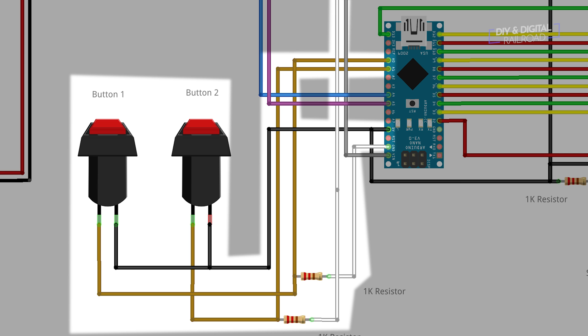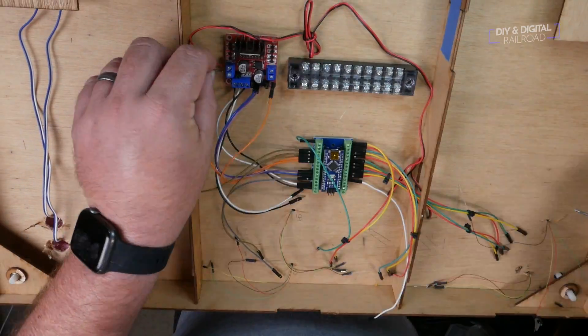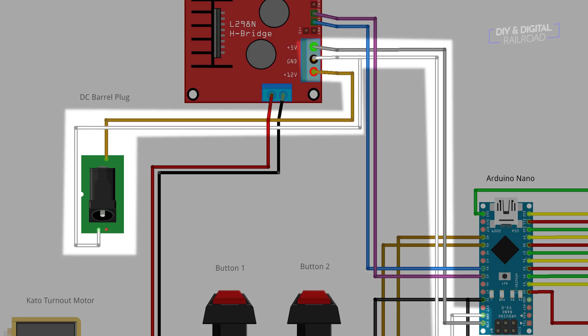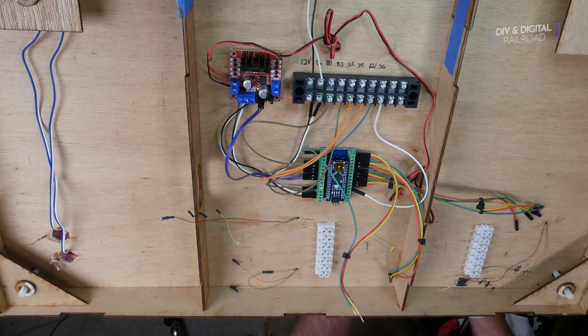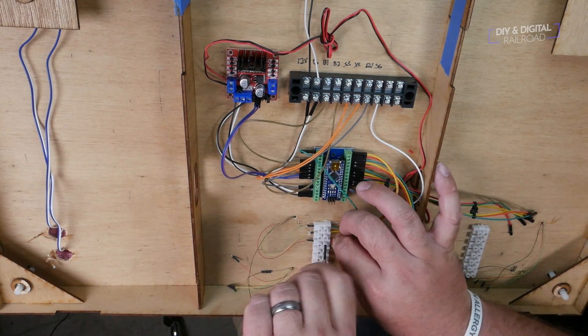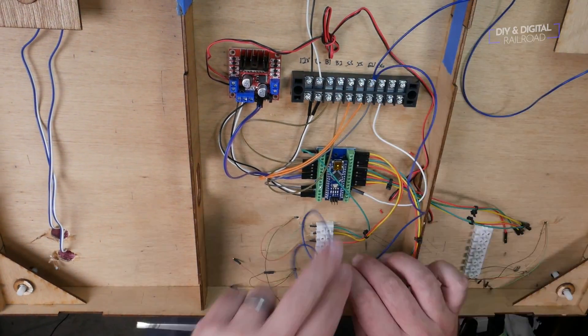We're going to connect the buttons to analog pins A0 and A1, and connect the motor driver to pins A4 and A5. These are analog pins, but I'm going to be using them as digital outputs. In my setup, I'll eventually need connections to other modules, so I'm routing all the power through the L298N motor driver — which has a five-volt output that can power the Arduino — meaning one plug powers everything. All parts are linked in the description, including these new white terminal strips you can cut to custom size. I used two seven-position terminals for the signals and power.